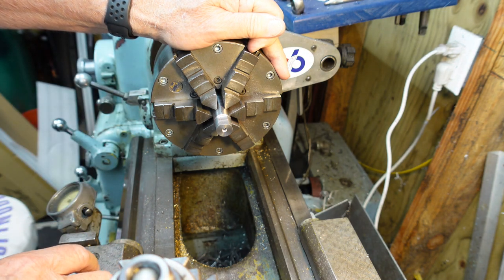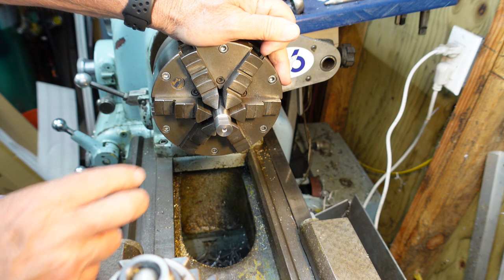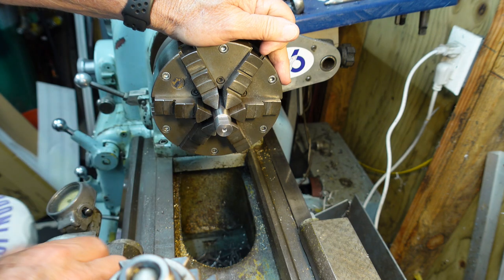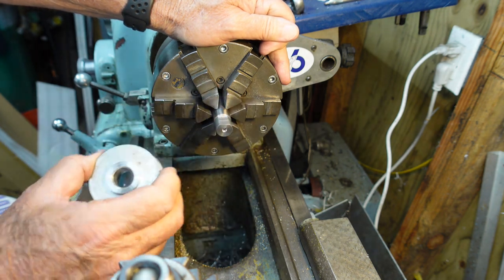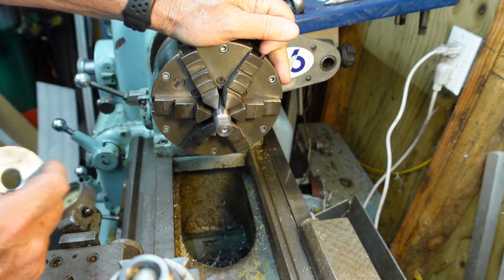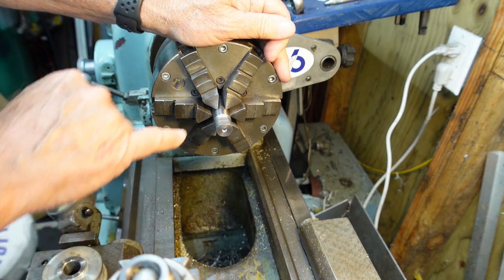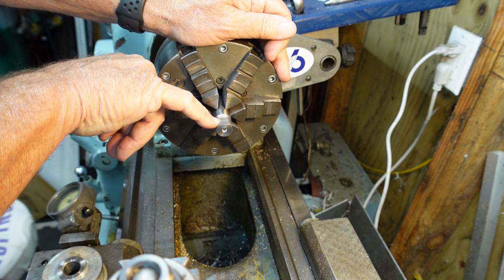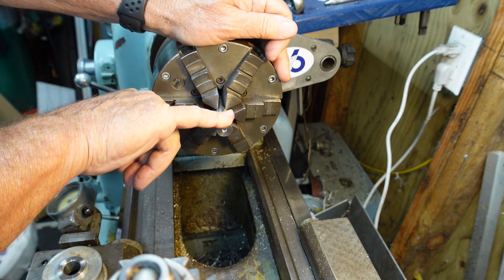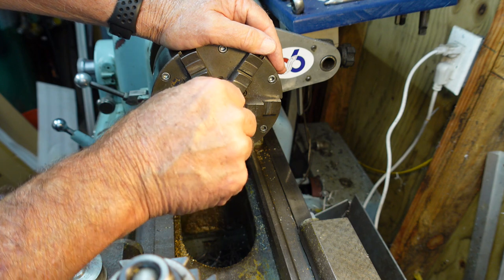There's a little math involved — it's a twelve-to-one ratio. What do you mean by a twelve-to-one ratio? You take the diameter of the part — excuse me, the diameter of the bore or your stub mandrel — and divide it by twelve. That number is the amount that you need to take off of the flat. That's your cut on your flat, and then your pin is basically the difference that fits in there.